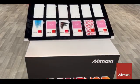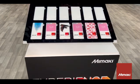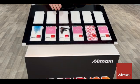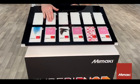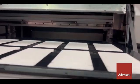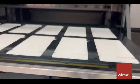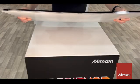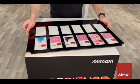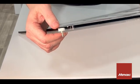To review some of the design considerations, I'll be using this jig as an example because it shows many of the features. This was designed to the size of the 6042 table. Generally, if there is any height difference between the jig surface and the material being printed, you don't want to use reflective materials. This one, however, is perfectly flush with the surface, so the glossy surface is the same as printing on a flat sheet of acrylic. But given the choice, I'll always go for a matte surface. This one is going to be fastened with thumb screws, so I'm going to layer the acrylic high enough to get over the top of the thumb screw head, which is just under 7mm.